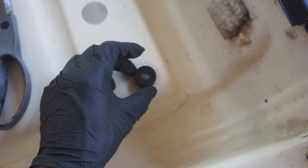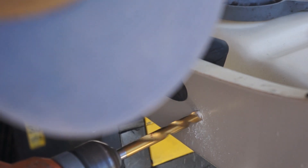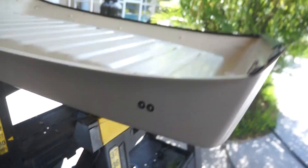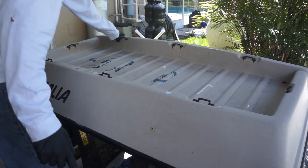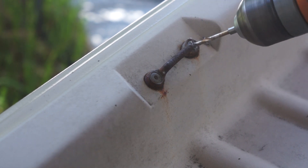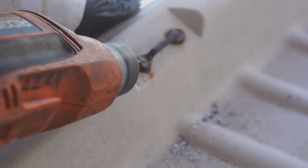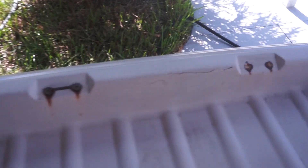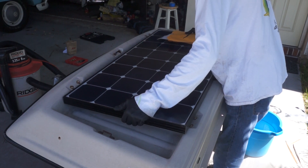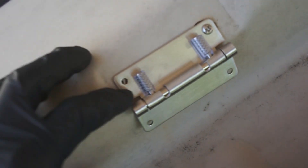I made sure to leave the rear driver side drain open so that we could feed the wires through it. I put a grommet through it to protect the wires. Next I drilled two small holes just large enough for the solar wires to fit through. I then removed the four corner strap hooks from the rack — this is where we'll be installing the hinges. I test fit the panel to make sure everything fit right, and installed the front hinges using the innermost holes from the original strap hooks as a guide.